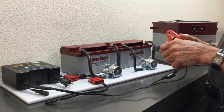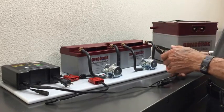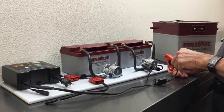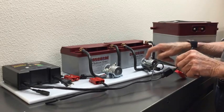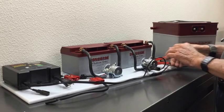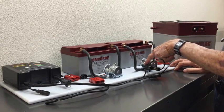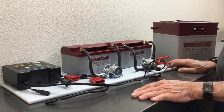First, we're going to hook up the alligator clips as it would be on an airplane where you'd have to find the battery relay, wherever that might be located. So we hook up the negative ground to the post of the battery relay, which is our negative bus. Then we hook up the positive over on the positive post of the battery relay. So we've got our positive connection going into the battery, and the negative going to the negative post of the battery. Now we've got our battery minder hooked up with a pair of alligator clips.